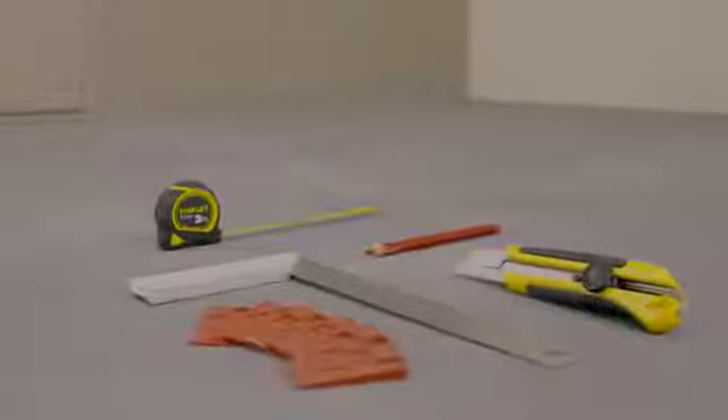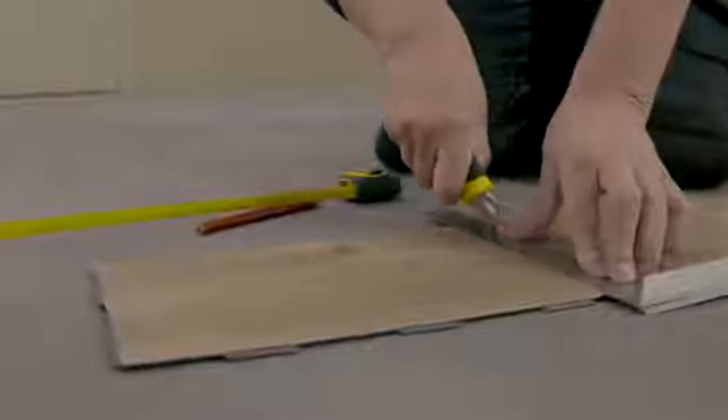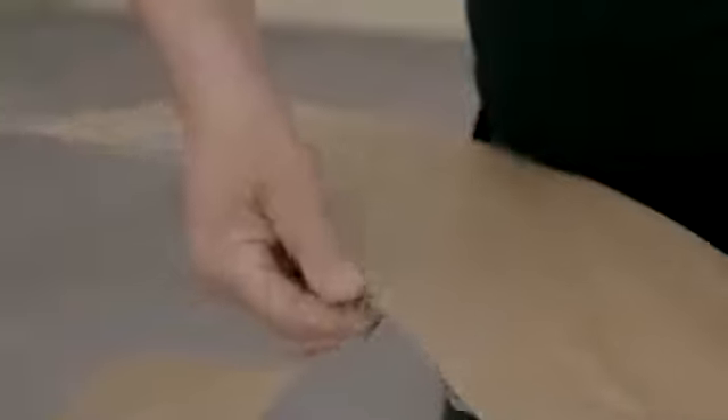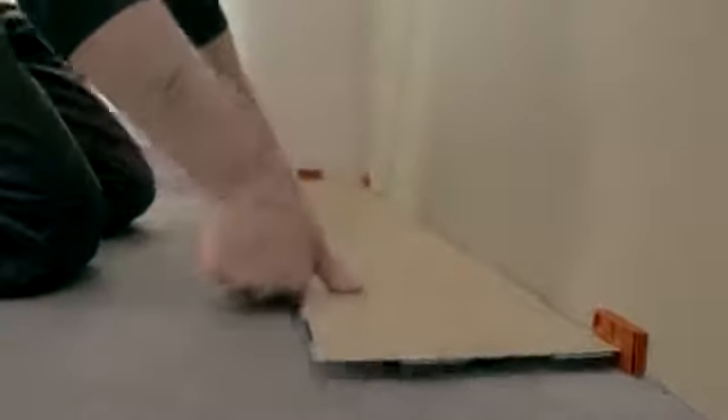You don't need to buy expensive installation equipment to fit your flooring — a Stanley knife will do the job. Remove the locking tabs of the plank on the first row on the side facing the wall. Start the installation in either corner of the room and click your way to the other side. Install spacers at regular intervals against every wall in the room. Start the next row where you finish the previous row.